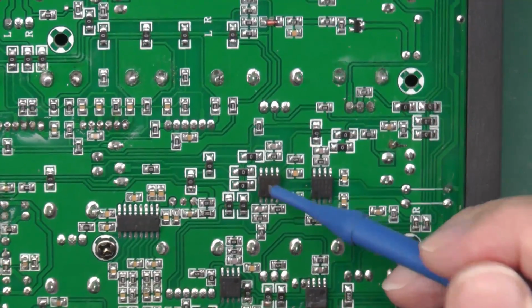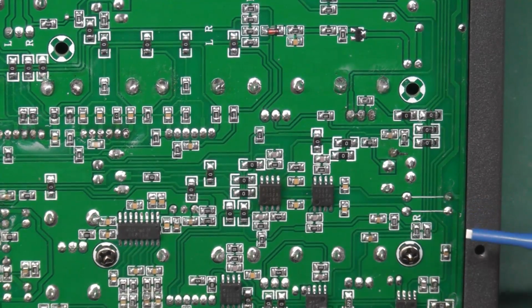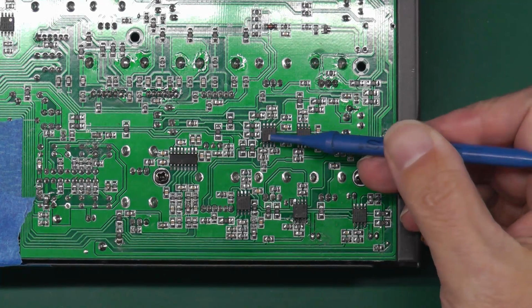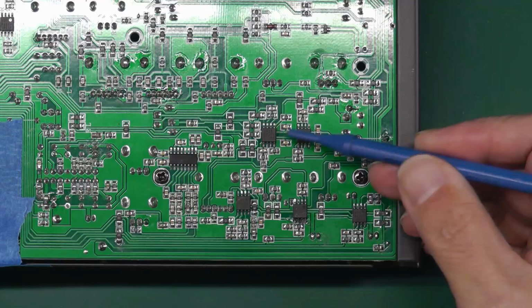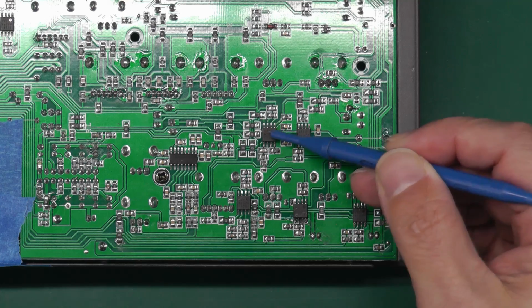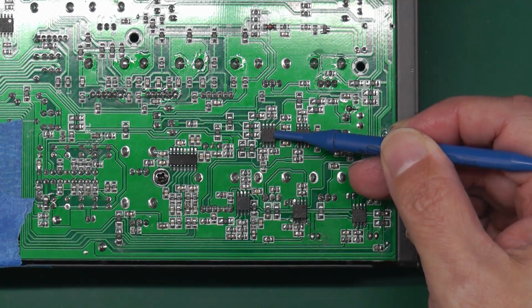So yeah, I think the first thing I'll do is change out the op amp there, and we'll take it from there. And luckily it's just in the normal standard pinout configuration, that 4558, and I'm bound to have something in my parts bins that'll do the job. Like I said, it's just a general purpose op amp, like two 741s in a single package. They're a single 8-pin package, so I'm bound to have something. Let me go and have a look.